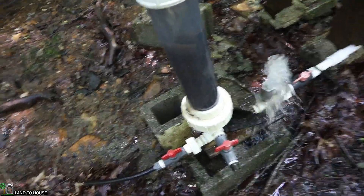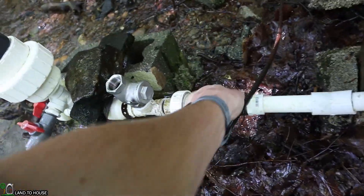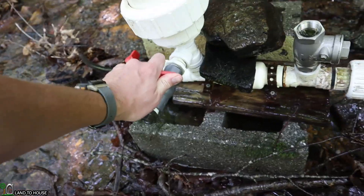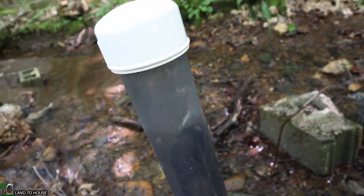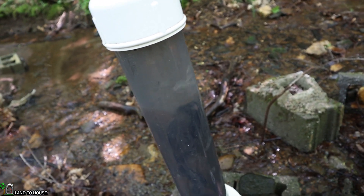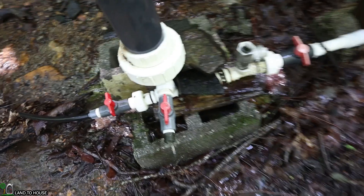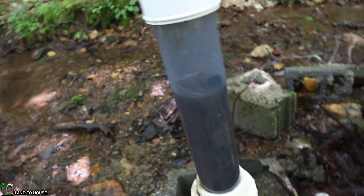Let's test out something here. If I close this delivery and also close the drive pipe, I can let out some of that water. It's going to replenish some air here in the tank, and we will start this up again so you can hear what it's like to have some air in the pressure tank. Okay, that's enough just for testing purposes. So you can see there's plenty of air in there, and we'll go ahead and turn this back on — we should hear a difference in the sound.